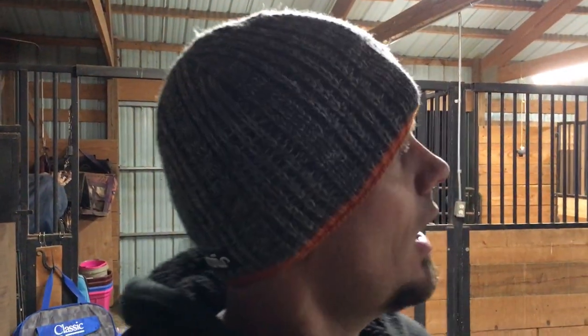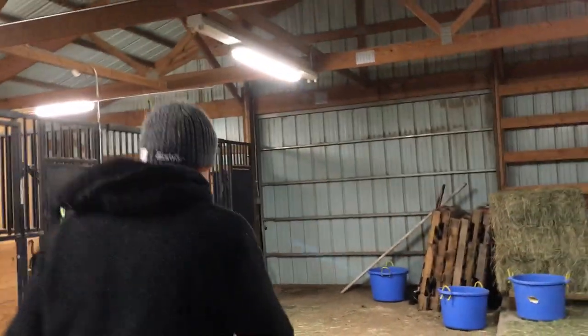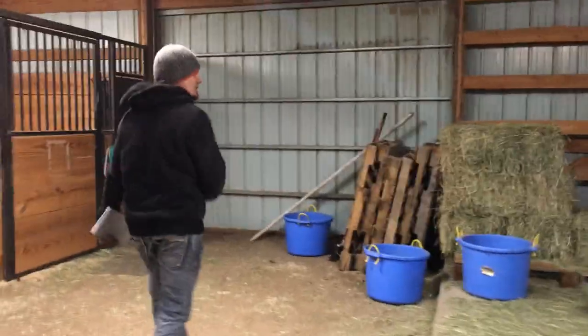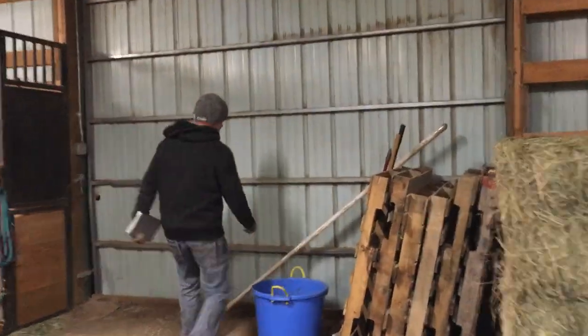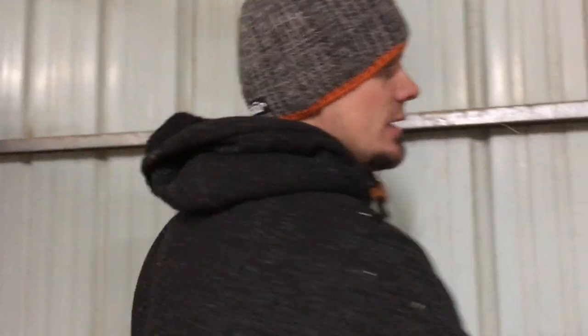Some people get really worried about the hay in the barn — I couldn't tell you how much dust came off of these covers. They had these old 96-inch, basically 8-foot, 110-watt high-output T8 tubes, and those things were not doing well.